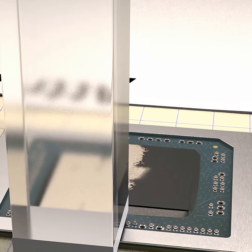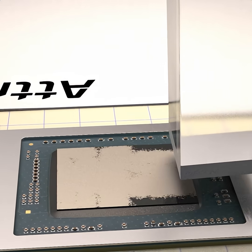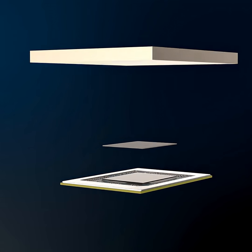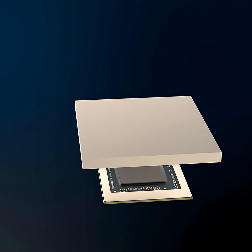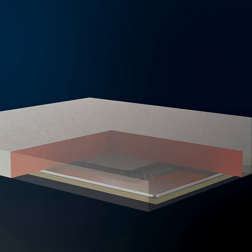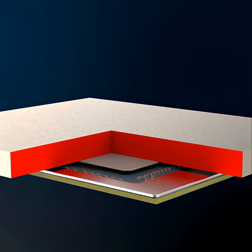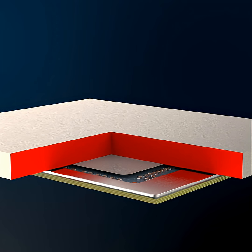This is why the Alma process includes a dedicated priming stage and applicator. PTM 7950 application may seem easier — just placing the pad and attaching the heat spreader — but for effective cooling the pad must undergo combined phase change and thinning through compression. Not all heat spreaders can maintain the correct pressure while the pad thickness is decreasing by hundreds of microns.